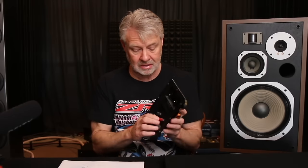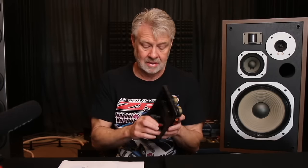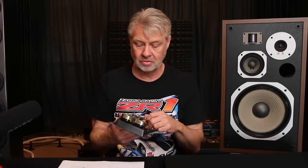Not only are they an iron core, but they've got steel screws going through them. There are little electrolytic capacitors, and they put these big pots on here so you could adjust the midrange and the tweeter. These are the worst things you can have in the signal path — especially when they get dirty, they're going to degrade the signal quite a bit. These connectors are just spring-loaded — you stick bare wire into them. That copper is going to oxidize, and same with all the wiring, which was 18 gauge or less. This thin wire is completely oxidized by now — you strip some of it off and it doesn't look like a new penny, it looks green. So there's a long way these speakers can go.